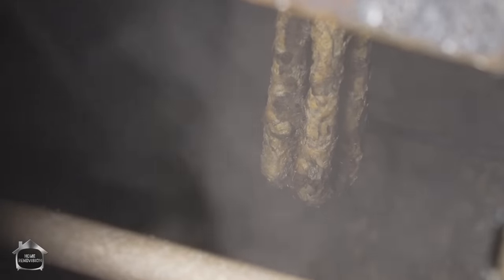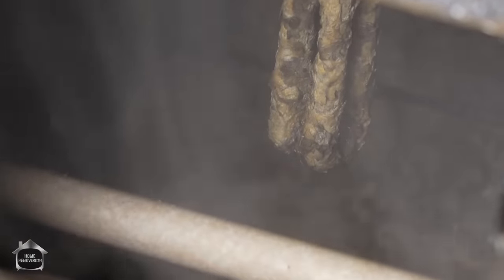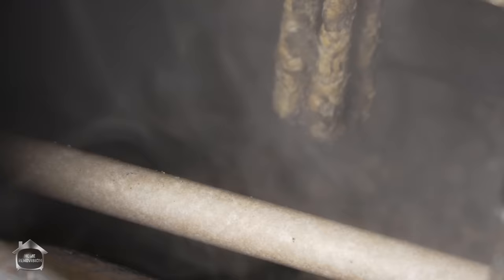So on the bottom left of the screen, that's the plastic pipe that brings the water supply. Wow. And then that big corroded looking thing is the heating element. And if you take a good look, in the background there's a black thin rod going from left to right on a slight degree of downward. That's the original aluminum anode rod, almost completely eaten away after only 6 years. Wow, folks, change your anode rods every 5 years. That is crazy.